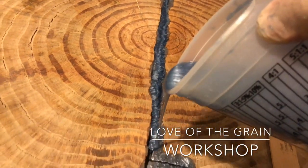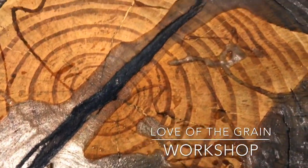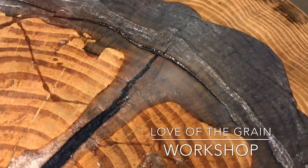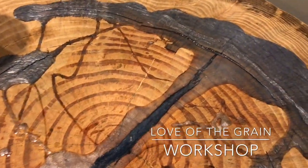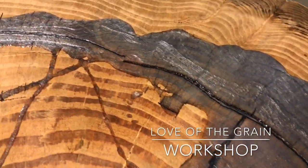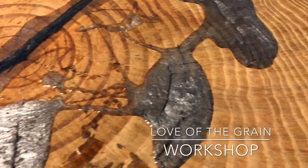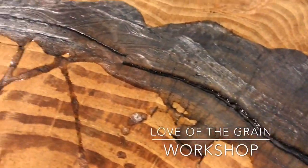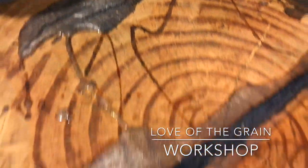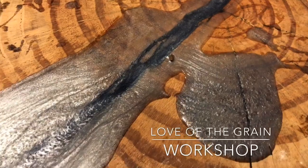That's pretty full — we'll let it sit for a bit and come back to top it off. It's been probably 30 to 40 minutes and we've done about two more pours over this surface. We're popping the bubbles with breath or a torch. It's starting to sink in a little more as the bubbles come out. We've used all the epoxy and it's starting to solidify, so tomorrow we'll come back and top it off — by then all the pores will be hardened and you'll just need to fill that small gap on top. There's been no issue with this deep pour given how narrow the crack is.